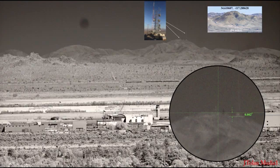Now, here's how well I can sight an object with the telescope and by zooming in on the camera. I have chosen the Quartzite Mountain about 54 miles away because it has some antennas on top. And I can pretty much align it to about 0.002 degrees to be conservative, maybe slightly better than that.